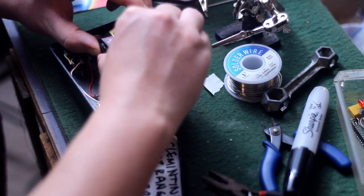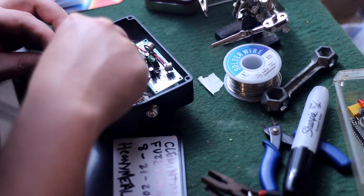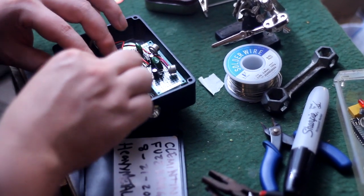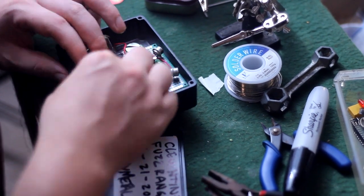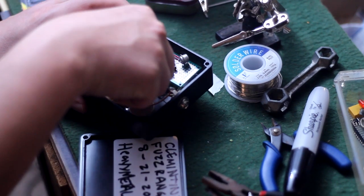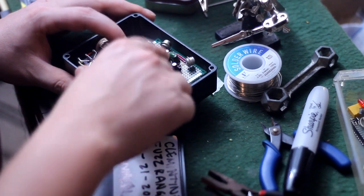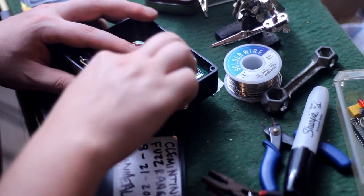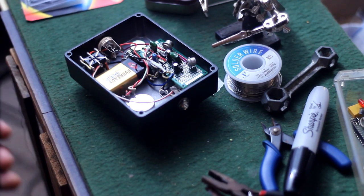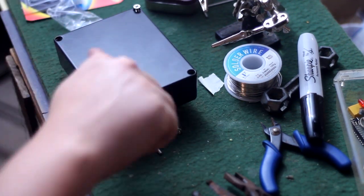I open up that pack and put a brand new battery in here. And if you look at that circuit, you can see that another thing I did to keep anything from touching something it wasn't supposed to is I pushed those two transistors over to give them some headroom. Now, if you remember, those things are socketed. I could pull them out, put other ones in. I thought I would be auditioning a bunch of transistors in this video, but the first ones that I picked up and plugged into each position were just perfect for what I needed. And one may say the reason for that is that I did build the circuit around those transistors. But either way, we're ready to throw the back on here, put the screws in it, and she's done.